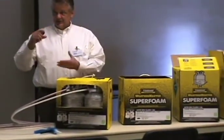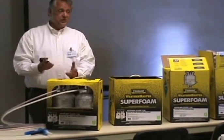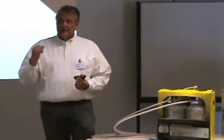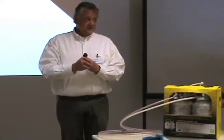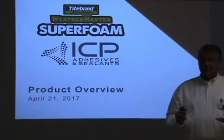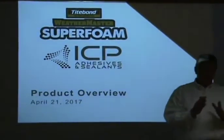The main difference: the current products that you have in the 24 and 12 ounce cans are moisture cured products. They're for anything smaller than your fist, so bead applications, cracks, sealants, things like that. Moisture cured means it needs moisture to actually cure. One component foam needs that.